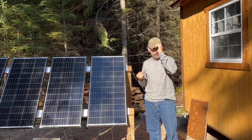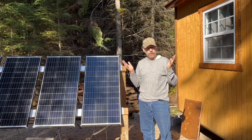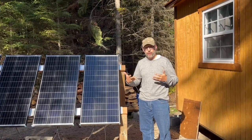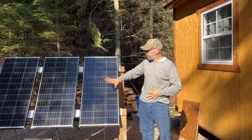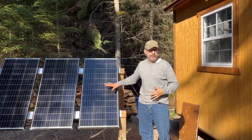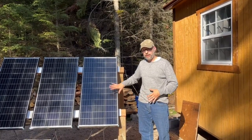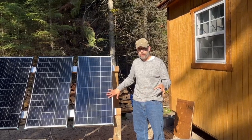When I first started researching the best way to connect my panels there was a real struggle — a lot of back and forth online. When I initially set up I only had four panels running, so I connected everything in parallel because it seemed to make sense, and that was fine. But when I connected the second panel bank it was way too much current coming in and I would just blow the fuse.